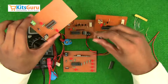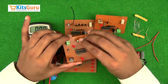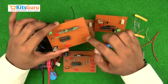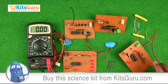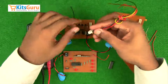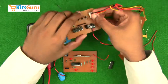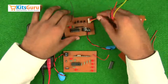Then insert the receiver module. As you can see, this is the antenna wire, so ensure the antenna port comes to this side. Then insert all 4 LEDs with the positive end towards us, along with the resistors corresponding to each LED. For the 6-pin connector, ensure the black wire is on the top side, away from you. This is how the connections for the indicators are done.